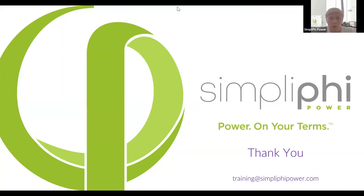Will a recording of the webinar be sent out? Yes, for all those who registered today, you will get a recording of this webinar. Question: how do you manage AC coupling given Simpliphi has a 48-volt battery? This is going to be handled by the battery-based inverter — the battery itself only sees DC power. The battery-based inverter, like the Solark or the Schneider, is the one taking power from the AC inverter and converting it to DC 48-volt power for the battery.